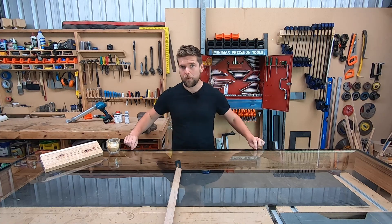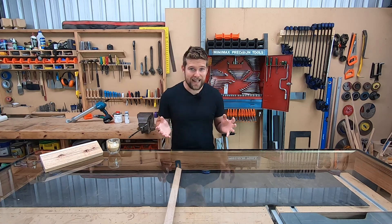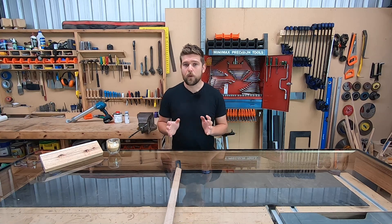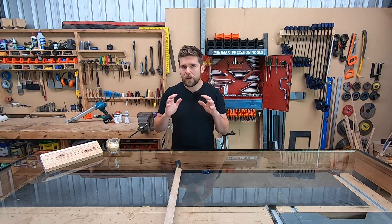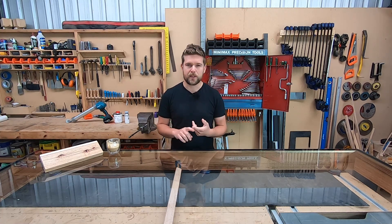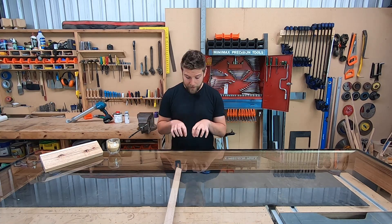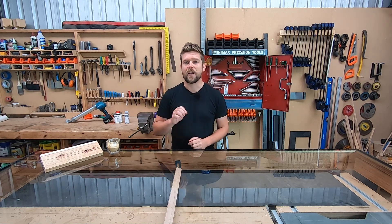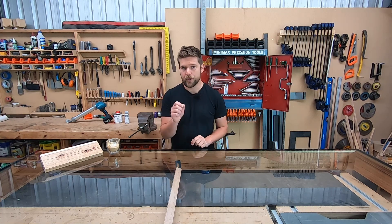The problem I then had was how do I form my black band around the edge of the glass? The adhesive is UV stable so I could use that, but it's adhesive so it's difficult to apply onto the glass and get a nice sharp line. There was also talk of a two-pack I could put onto the back of the glass - apparently one used for glass splashbacks - that could give a black band that's UV resistant and block UV getting to the adhesive. But I never found the name of that product, so I didn't go with it. Instead, I ended up using the SG20 to form my band, and I'll show you how I did that in a moment.